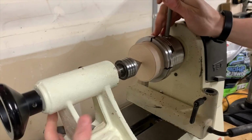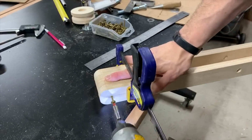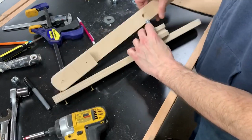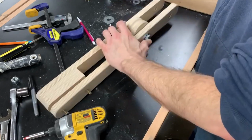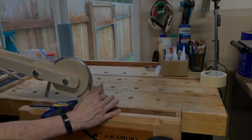A wooden block acting as a stopper is attached to the left side of the secured template. Insert the workpiece between the block and the template and with consistent steady pressure, press it against the outer diameter of the template. To achieve a good result, the key is to ensure that the workpiece doesn't slip off the template. It's worth noting that a homemade device will be much cheaper and it won't compromise on quality.